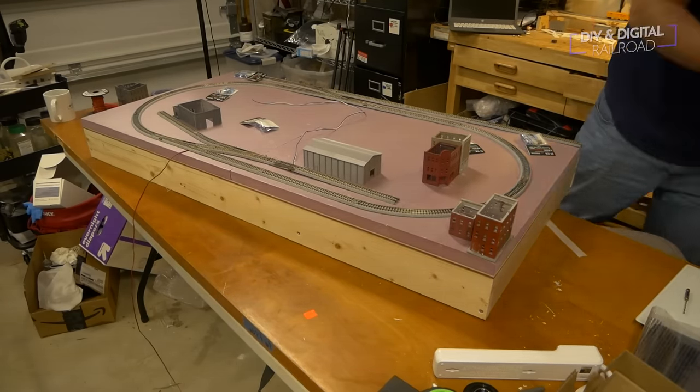Once we wired everything up, we go ahead and plug in our 5-volt power supply and do a quick test. It looks like all of our lights are working, so we can begin to seal up all of the lights and all of the other wires and then connect the switch that will control them. I use hot glue applied to the wire holes to seal them in. This will lessen the chance of the wires being pulled and snapped off.